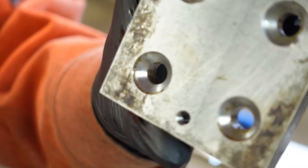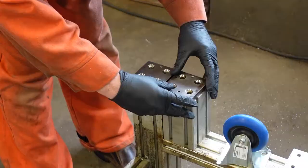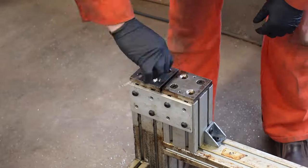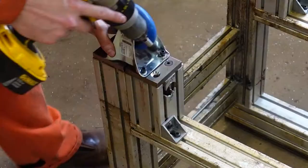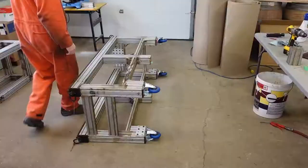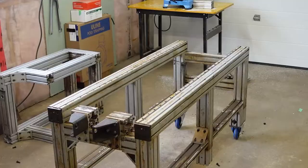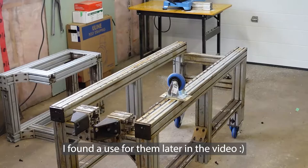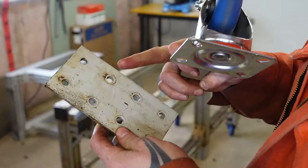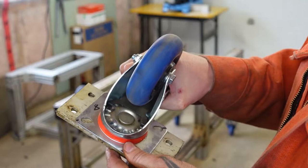Fortunately these plates already have tapped holes for where we're going to put the casters. I'm just going to remove the parts that I don't really need, like the linear rails. I need to countersink the four metal holes so that I can mount the wheels on top, and I'm going to need to drill and tap four holes so I can mount the wheels.